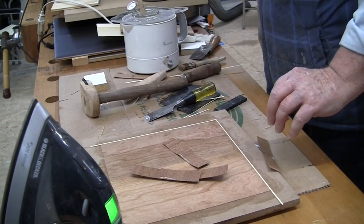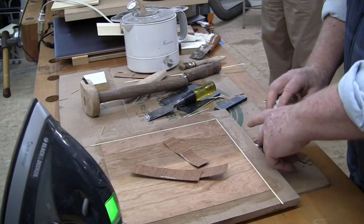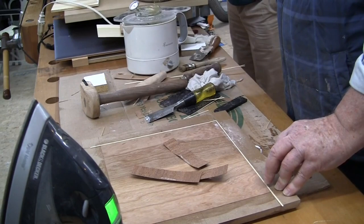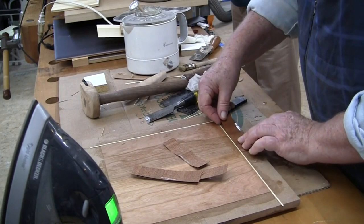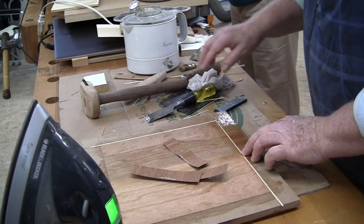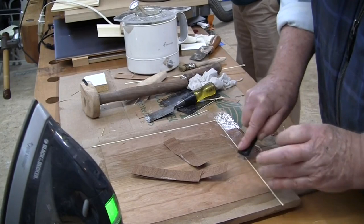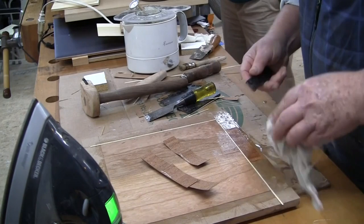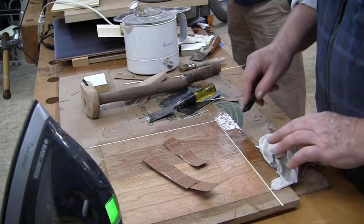Okay, so I'm going to wet this, and the chalk was over here, and it's going to the outside, so I have to keep this orientation. I'm going to move it over, so I have to do a join. So this is a very strong grain wood, so you really never want to hammer across the grain if you can avoid it. Preferably, because you'll stretch it, and then tomorrow you'll come in and it'll be cracked, okay? Because I already have a boatload of water on this thing, so it's already swelling.